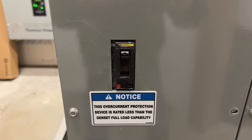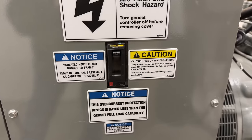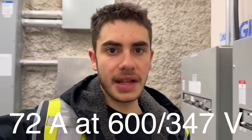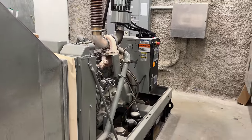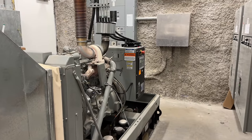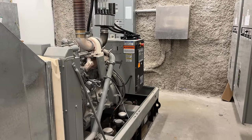On the generator, the 40 amp breaker feeds the general backup power and the 70 amp feeds the life safety transfer switch. In total, this gives 100 amps at 600 volt — 347/600. That's what we use in Canada. In place of 480, we use a slightly higher voltage, a little bit more power, so we use 347/600. That's what this generator produces before it goes through the emergency transformers that feed the emergency panels, stepping it down to 120/208, which is what most of the emergency systems use — except the smoke exhaust fans run right off 600 volt.